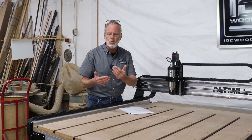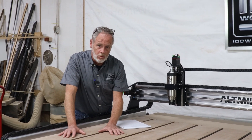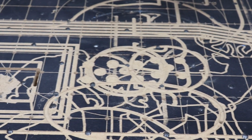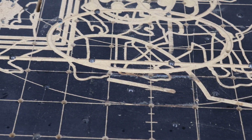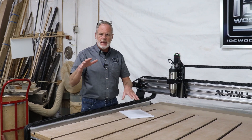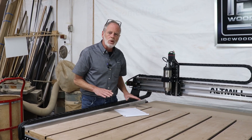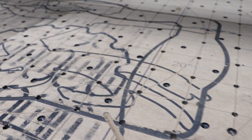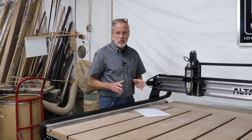There are multiple different times that would warrant resurfacing the spoil board. Number one is the whole purpose of a spoil board — it's made of a soft material. As you cut out projects, sometimes you're going to actually cut into the spoil board, like you can see on my other CNC router here with these marks. Over time you're going to have so many cuts into it that it's going to be hard to clamp down your project, and at that point you need to resurface the whole thing to re-level it and clean up the messiness. Eventually you may even have to replace the spoil board.